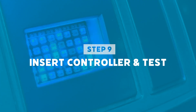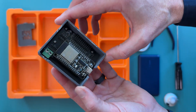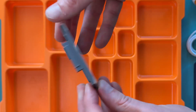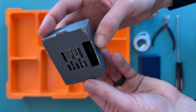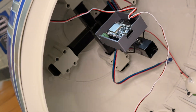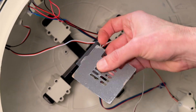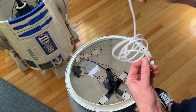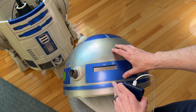Our last step is to insert the controller into the box that's already installed in your R2. Note that there's an arrow in the box — the green 5V connector should be at the top and the USB-C connector should be at the bottom. The pull tab on the lid should also be pointed up. Go ahead and click it into place. Over at R2, make sure USB-C is on the bottom, everything looks good, your cables for the FLD and RLD are off to the side, and your 5V connector is in place. Put the lid on — there's a cutout on the side for all your cables, so just make sure they're routed through it.